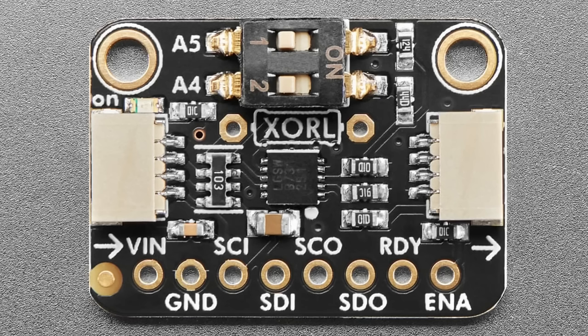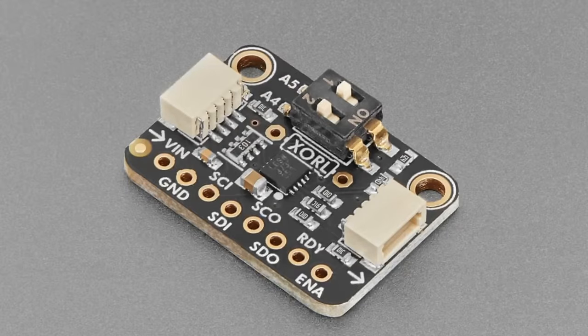If you need more address options, there's a spot for the XOR low bits (three bits) where you can solder in a 10k or 47k resistor to flip other bits — check the data sheet for a table showing resistances and which bits get flipped. It's not as inexpensive as a multiplexer, but it's a nice transparent way to change addresses. One warning: it doesn't support clock stretching, which would probably confuse it.